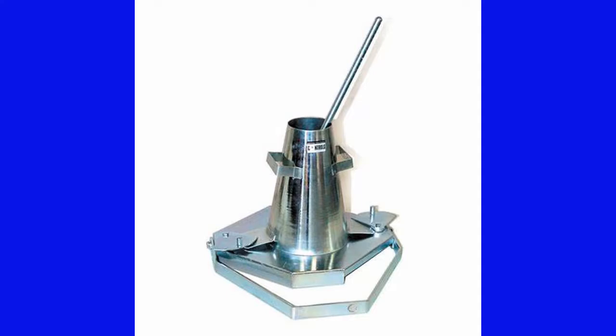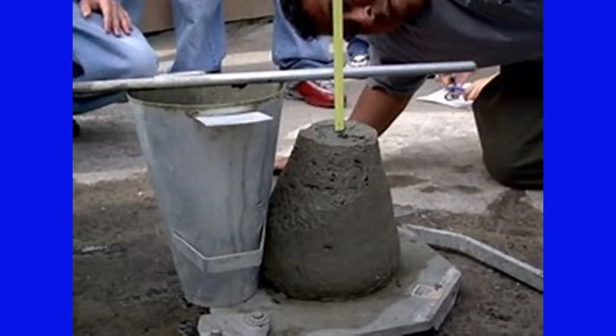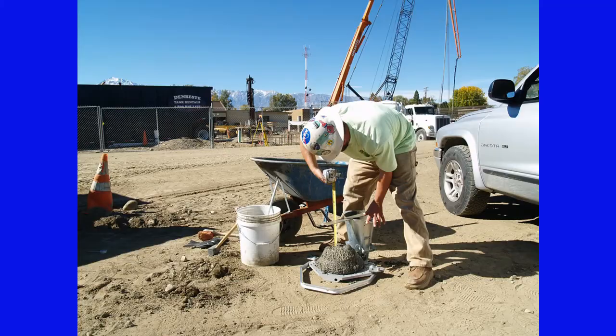The testing for slump is different than that for Portland cement concrete. The concrete is dispensed from the mixer and allowed to rest for 4 to 5 minutes prior to conducting the test. A standard slump cone is then filled per ASTM guidelines and pulled and the slump recorded. Typical specifications call for a 3-inch to 7-inch slump for HPLMC when used with a Type 1 cement. When using a very early strength HPLMC, the slump is normally specified in the range of 6 inches to as much as 10 inches.